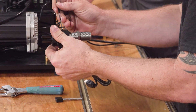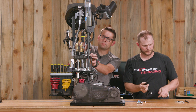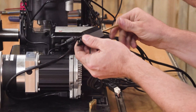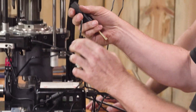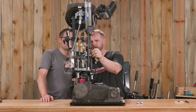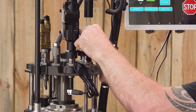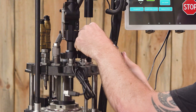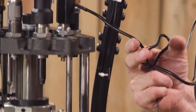Using a 5/64ths Allen key, break the set screw loose on the sensor and remove the die body. Start threading the die body in most of the way. Take the micro rod, put it through the housing, and thread the appropriate probe into the rod — it doesn't have to shoulder out, just make sure it's snug. Then throw the sensor body up onto the die body and snug it so it still moves but won't come off. That looseness is intentional for height adjustment. Snug up the set screw in its groove, then back it off to allow movement of the die body for your powder charge setting. Plug the cable into port number 4.